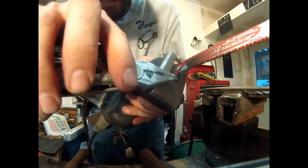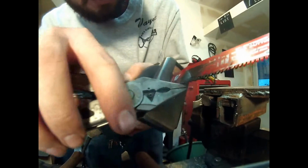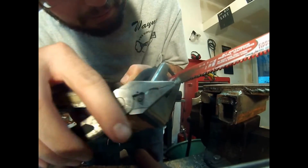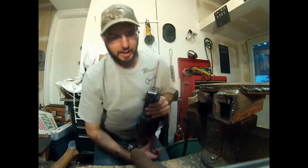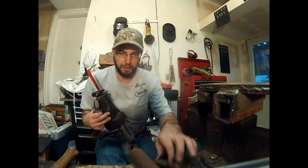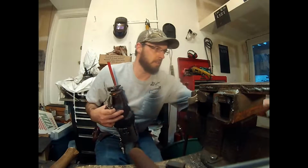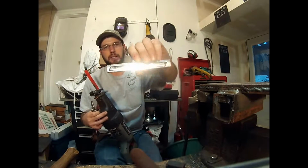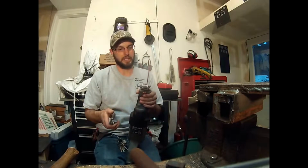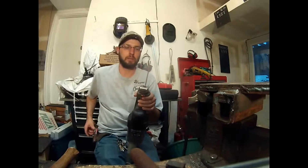And we're beginning to see some teeth starting to fail. So the carbide's getting jerked out of these. I would assume these two here do not have any carbide left on them. But look at all the stuff we cut. I mean, this is still the same blade that we cut wood with nails, 3/4 inch steel, our tool chrome vanadium wrench, cut through that, and just now it's starting to break down. So that's pretty impressive to me. We'll keep going with this thing to see what it can really do here.